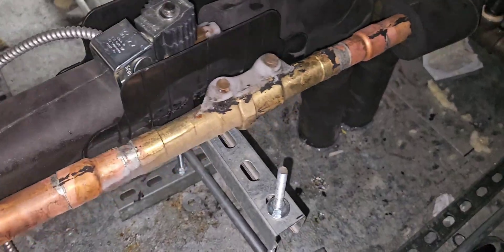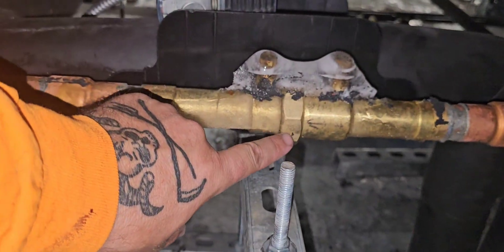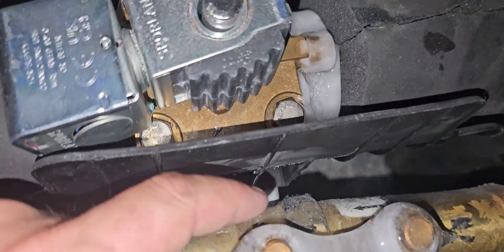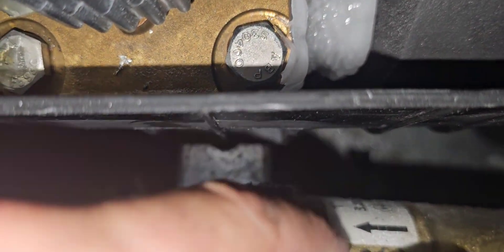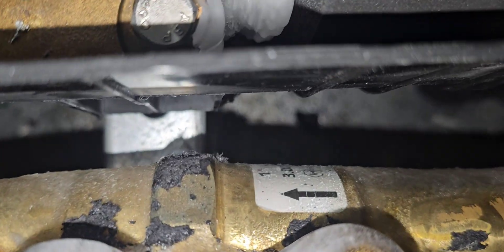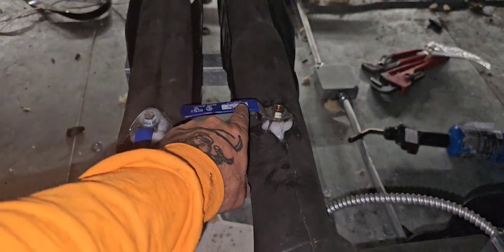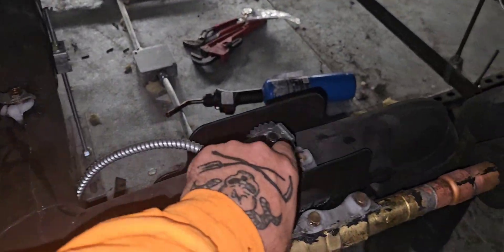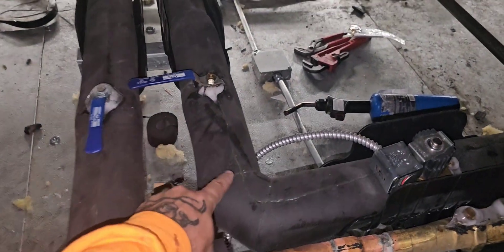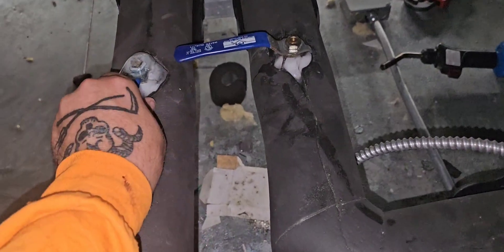Got the insulation off. As you can see, this is just a brass valve and it's got a union on here. We'll have to melt this ice off first. This one is actually a 3.0 GPM - so we're changing it out for a 7. What we've done first is turned off the supply line. The idea is to kind of pump it down - it doesn't really pump down like a traditional refrigeration system, but there is higher pressure on one side than the other. Now that we've had it pumped down for a bit, we're going to proceed.